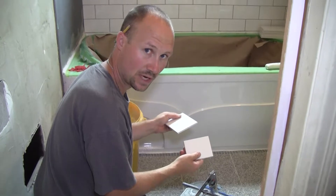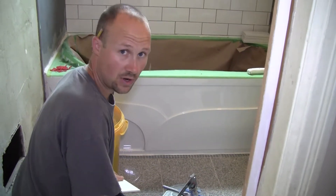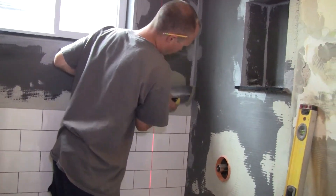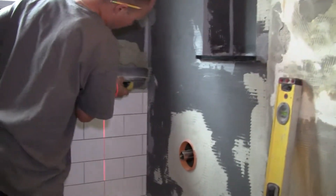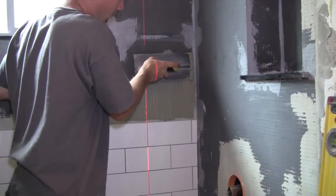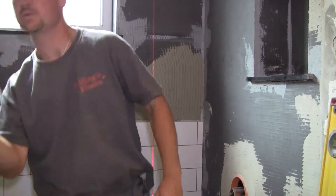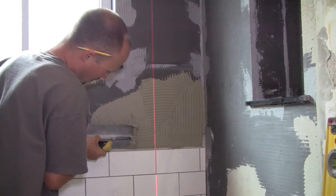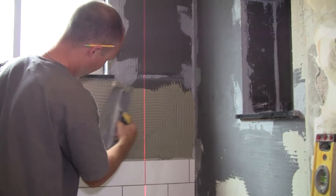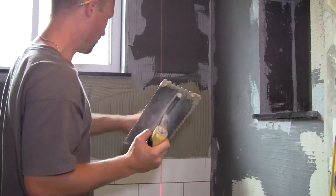You can see how much faster that is than running out to the wet saw or angle grinder — it scores and gives a nice clean line. Now we'll get our mortar; everything's mixed and spread out. Remember, you can't over-spread — it's better to have enough mortar. This time, spread for a few tiles at once, coming over about three rows or so. Don't worry about any mortar falling down.